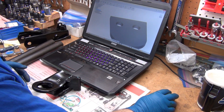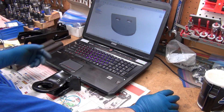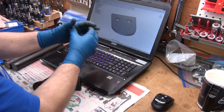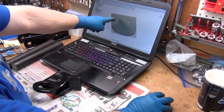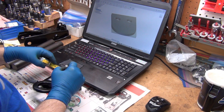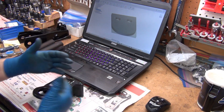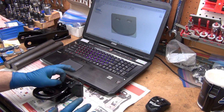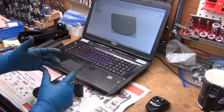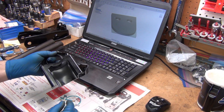I've got a simple representation here, and the only reason I put the radius/arc section in is just to signify which side of the piece this is - I could have just drawn a square with a hole in the center where I've got my origin. I set it in the middle because I want it to be basically 0.8 by 1, and anything within a sixteenth to an eighth of an inch is perfectly fine. It's just a sway bar mount and a very long mount link, so I just don't want to get the hole too close to the side because then if the bolt angles over, the nut on the underside - which is why this is clearanced - will hit the side wall.